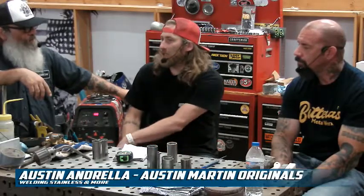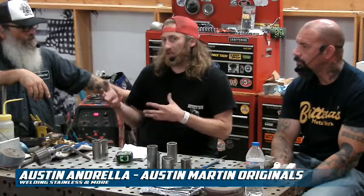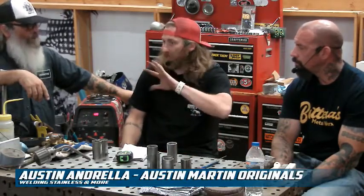That's a nice part about this. Knowing it and being good at it, you have the ability to play with that pedal, get your heat and your speed. You still want to get it set close because that's one variable you want to rule out. You don't want to have to worry about how hard or how much you're letting off. A lot of times the heat starts to build up in the part, so you're going to taper off a little bit with your foot pedal anyway because it'll flow easier as you're welding the part.